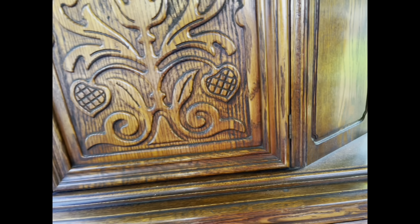That was time-consuming but I got all of the wax on the piece and it's looking pretty good. Now I'm ready to protect my top. I have my wipe-on Poly in satin and I'll be using it to protect the top of my piece. I don't have to do this, but because this is a buffet and it will be used a lot, I decided to add the wipe-on Poly. I will be adding two coats, sanding in between. The wipe-on Poly is really easy to use and if you do furniture and haven't tried it, you better get some.